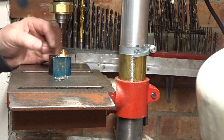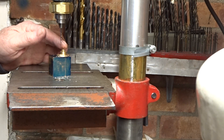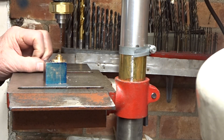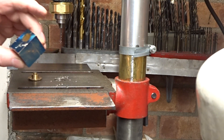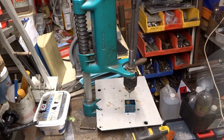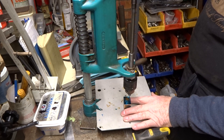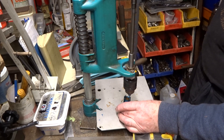So what I'm doing here — I've got some pieces that will eventually be cylinders, a couple of cylinders for the little locomotive I'm making. I've made the cylinder end covers and I'm now drilling and tapping to attach the end covers to what will be the cylinder blocks. That is tapping size for 10 BA. So I've just drilled, using the cylinder cover as a guide, the 10 BA tapping hole in the end, and now using this homemade tapping machine, just tap the 10 BA hole.